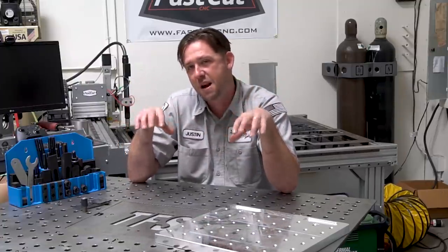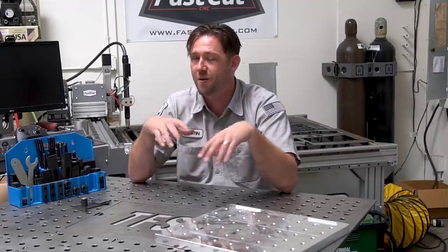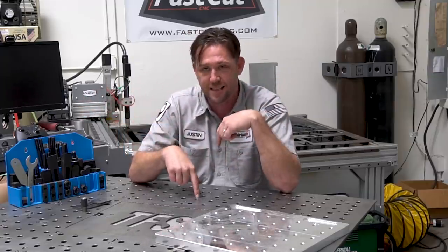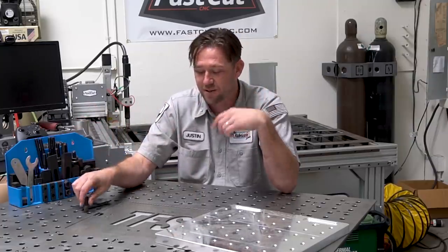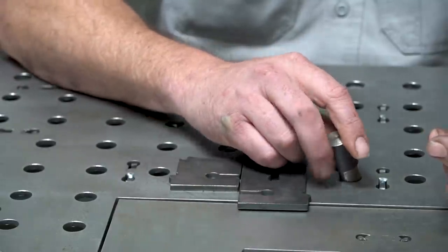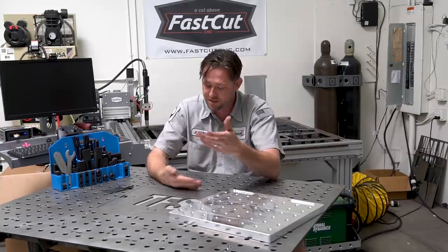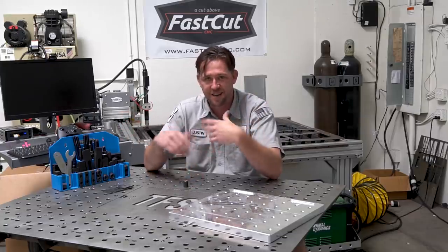So you don't really have to worry about copying or finding somebody else's, but they do have a few things about them that are very typical, such as the size of the hole, which is usually either 5/8 or a 16 millimeter, which means that diameter of that hole will facilitate holding a pin or something else similar to it, like a clamp or a bolt or a stop or anything else like that that is of that diameter.